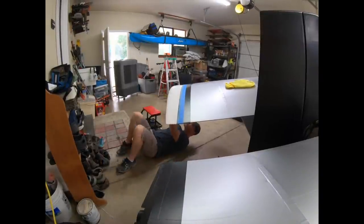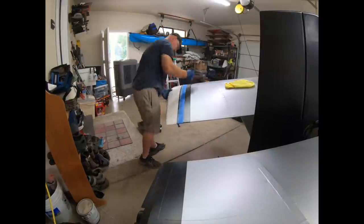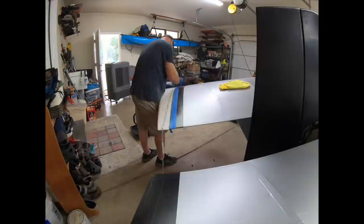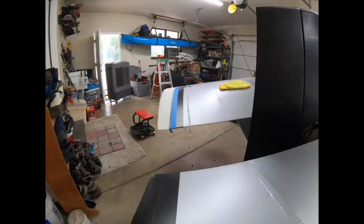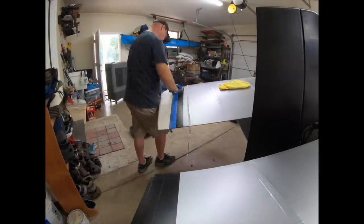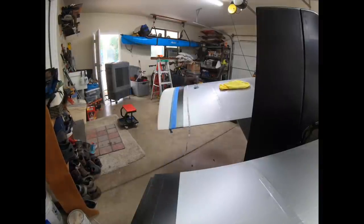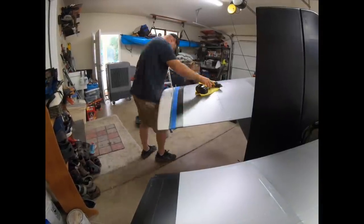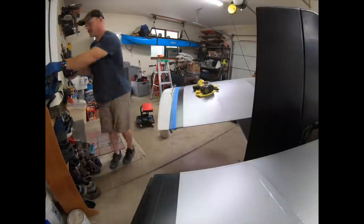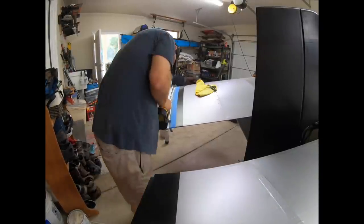Now that we've got the bodywork done, I'm going to go ahead and mount up the wingtips to the wing. We mark off a four-inch spacing to drill these holes, and you start at the aft end picking a location that's not going to be too thin to put the screw into. You're going to move up from the trailing edge enough to give you the width of your screw that will eventually hold the tips on. I did top first, then moved on to the bottom with the spacing at four inches, starting out with a number 40 drill - we'll enlarge those later when we put the nut plates on.